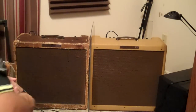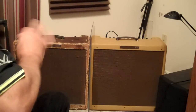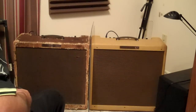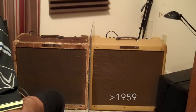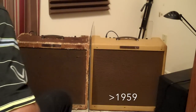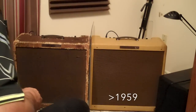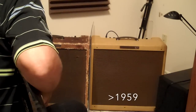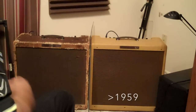Alright, I'm just going to try to make this fast. I'm going to run through a few chords and whatever. I'll try to keep it equal on both sides, but I'm on the right amp, the 1959 with the new 1028 Ps. Believe it or not, that's clean. I do have the Vibe Baby in cancel mode, which gives it a little boost, and I've only got it on a little over 3. I'm not sure where all that gain comes from. Oh, it's the 5751, probably.